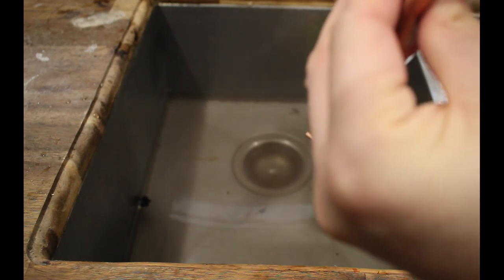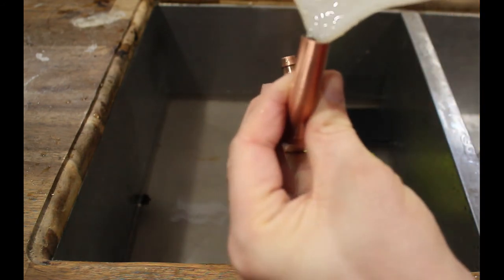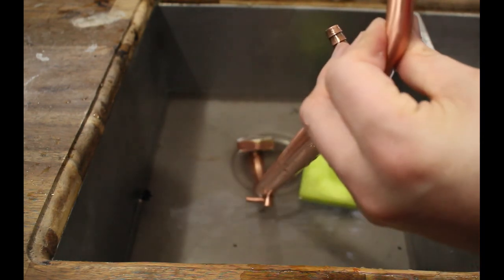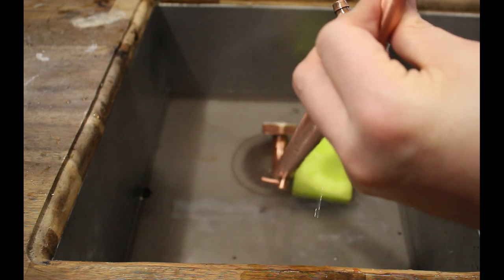Detergent can strip your copper, become deposited, or otherwise damage the still. This can lead to damage similar to bleach deposits that taint every distilling run for a long time afterwards. Salt is the final thing not to use. Salt and copper will react, and it can also react with stainless steel. In both cases it can cause tarnish, and with copper in extreme cases it can start to strip away or remove large sections. This owes to the sodium and chloride in the salt disassociating and interacting with the metal ions.